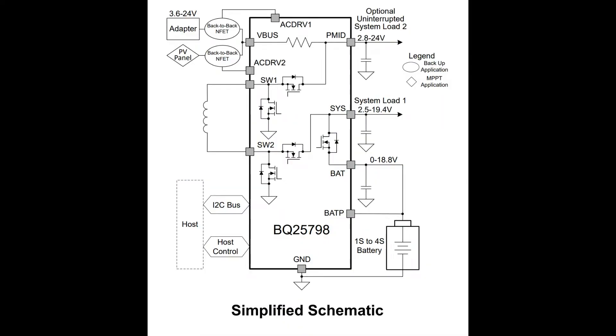What I like is it's a very simple chip, not a lot of components needed. You can use any kind of lithium ion or lithium polymer battery from 1S, like 3.7 to 4.2 volts, up to 4S, which is 4.2 times 4. It's a big battery pack so you can use it for scooters and stuff.